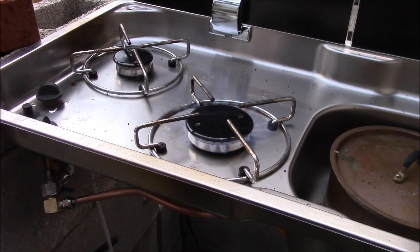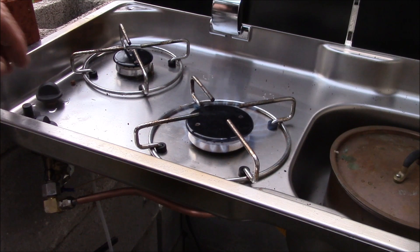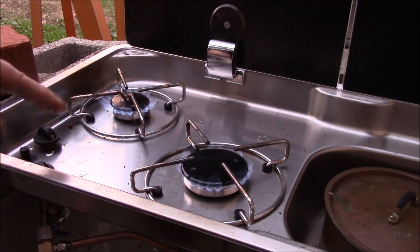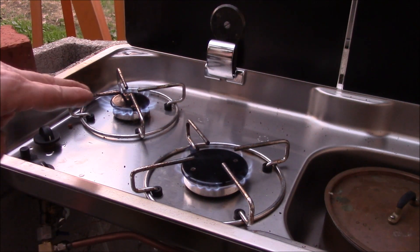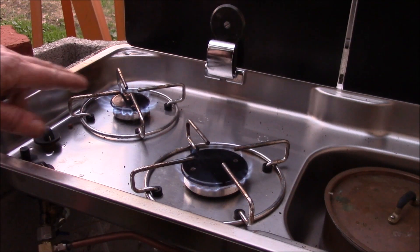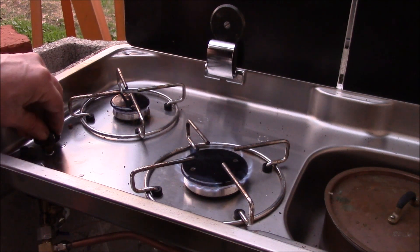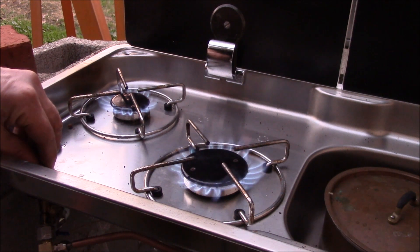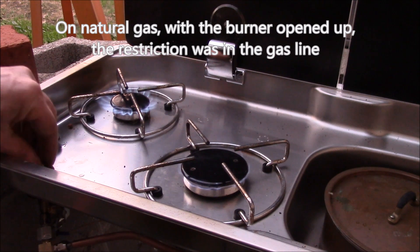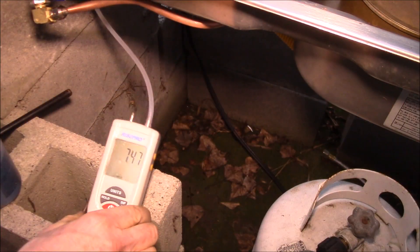I just don't think it's really worth doing the small one. According to the gas meter I am limiting the heat output just a little bit, so I think I'm going to call it quits here. That's what I was looking for — a reasonable amount of control on the flame. The problem before was the supply jets were so small that all the restriction was in the burner, so the valve didn't do anything: full flame until you hit the bottom, then minimal flame, nothing in the middle. Now the main restriction is in the valve.